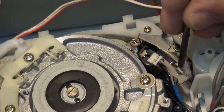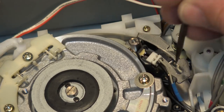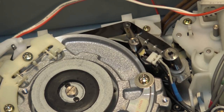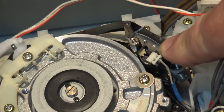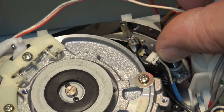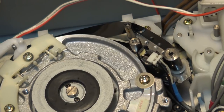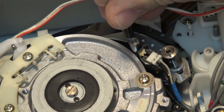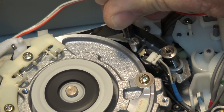Some of the other ones actually have a little V-groove here that the guide rests in, and you have to be sure that debris doesn't get jammed in there, because if it does that guide won't extend all the way into its fully loaded position. Right now you can see this is rigid — it doesn't move around much, you have to put a lot of effort to wiggle it because it is locked in place. You can see the spring when I compress it. But if it doesn't complete the loading cycle, or if a gear has skipped a tooth, this guide could be back a little bit, which changes the angle of the tape and you get lines in the picture.